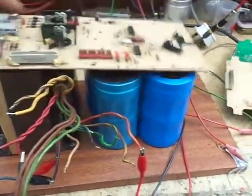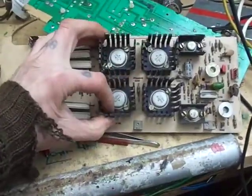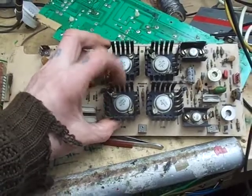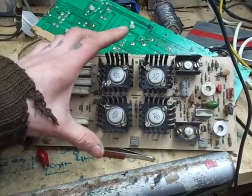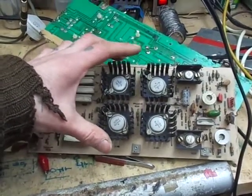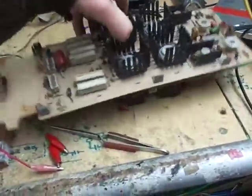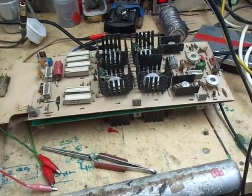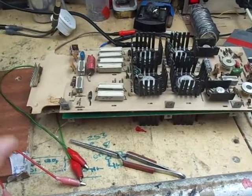Get this power supply up and going, power these up, but take the transistors off these silly bloody heat sinks — because this mixing desk was a powered desk for live recording and had a fan. This isn't going to have a fan because it's going inside a big subwoofer. I'm going to put those on separate heat sinks, and the idea is to bridge the output to get roughly a 400 watt amplifier.